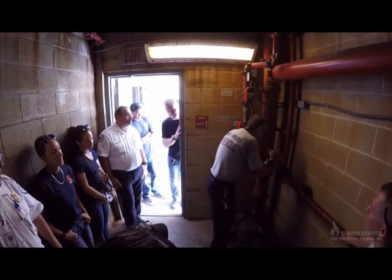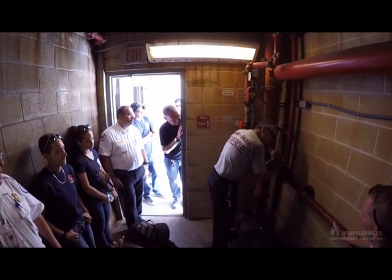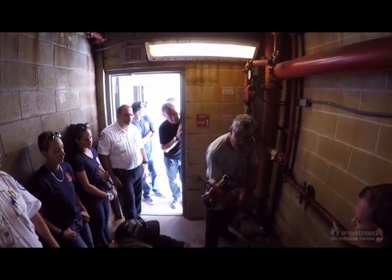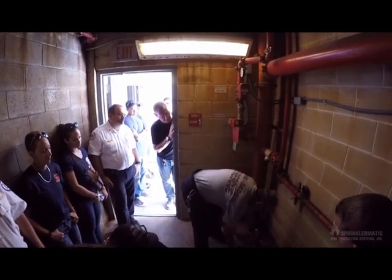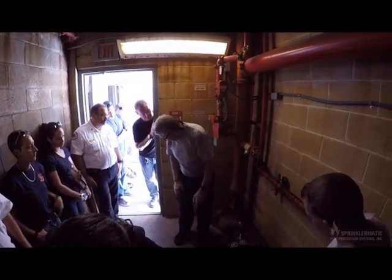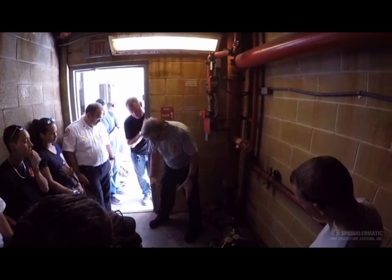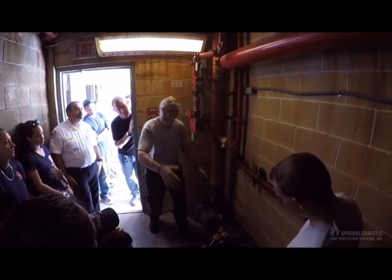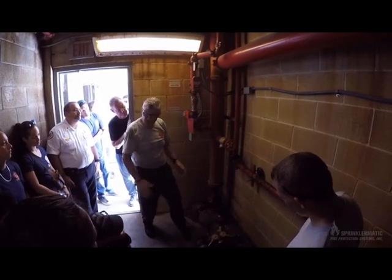Now, a couple things. We're going to go ahead and flush this thing. What we did is we improvised a Y to a Siamese connection. Guy in the last class said, well, what about if we took a couple of pigtails or maybe one length of 3-inch and brought it out here? Would that be maybe less in the way for evacuation? Yeah, I think that's good.